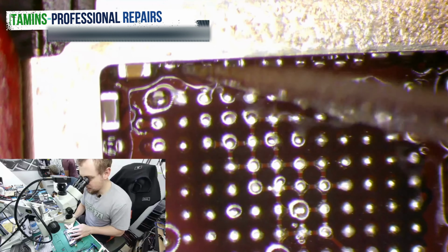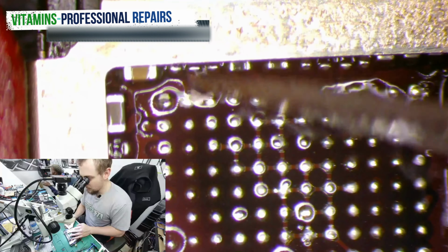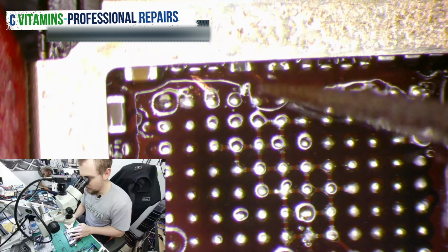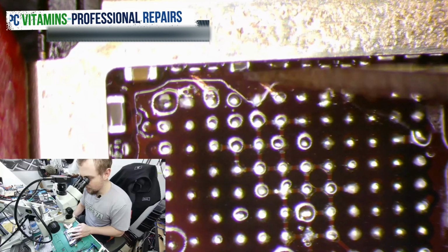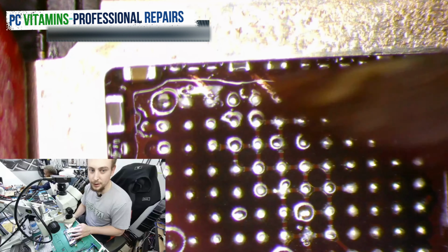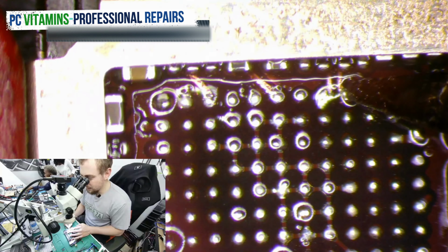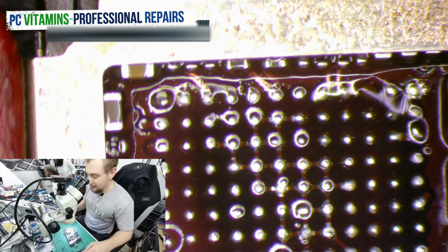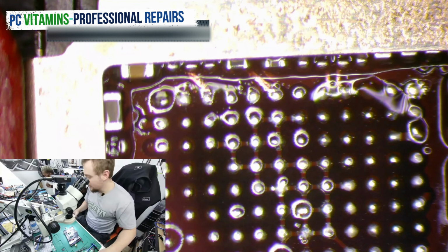Make sure that you add little jumpers. Normally, guys, it's only this IC where we do a jumper, but normally I just take it and reinforce it with a blob of solder on each one so that it doesn't break. I've had in the past where this one is broken or this one is broken, but this one looks firm. This one seems secure, but I bet you if I touch it with an iron, it's going to break instantly. So let's get down to business.